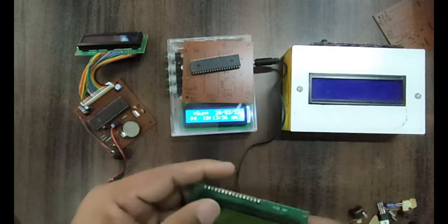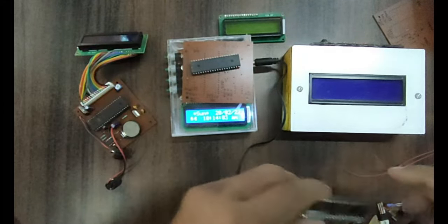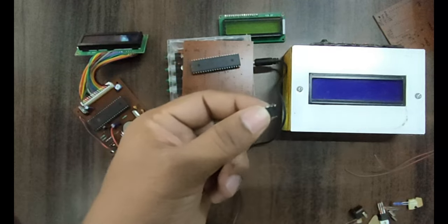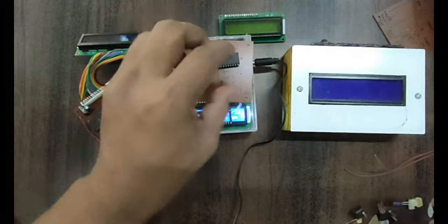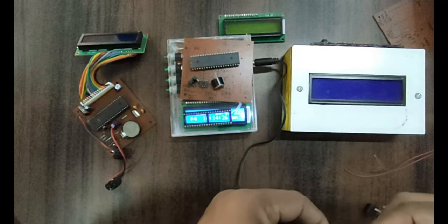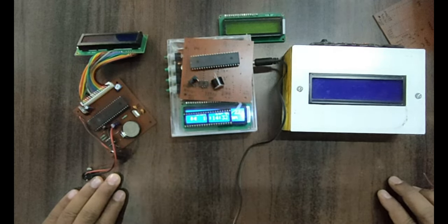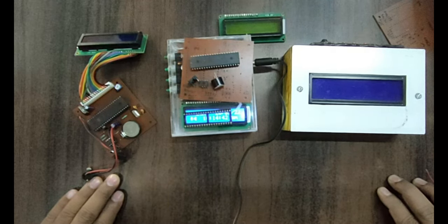Second, you require a display, a 16x2 LCD display, and a base for the IC, which is a most important thing. Then you require the RTC, real-time clock. This is the DS1307 RTC, which is easily available, along with a buzzer and many small components like resistor, diode, potentiometer, preset, etc. All these details you will get in the description below, or you will get the circuit diagram at the end of this video. You can download it, take a screenshot of it, and download the hex file.